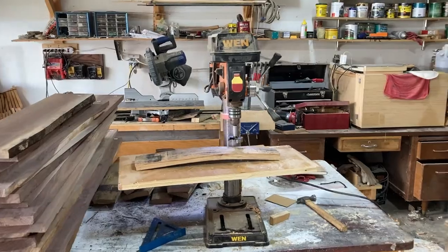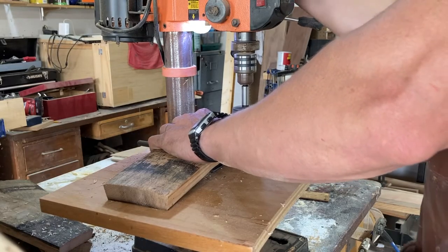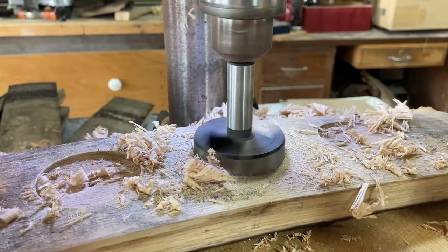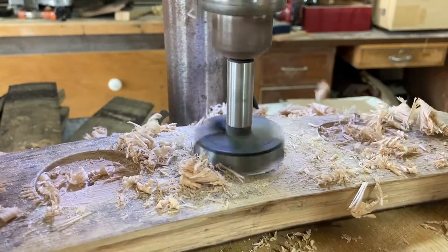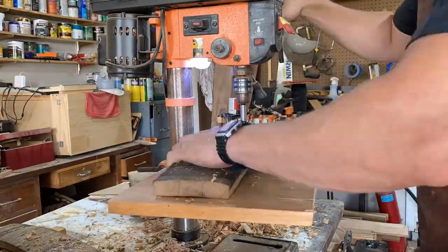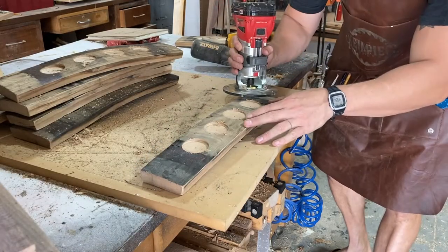You can see here I had to build a flat jig to go on top of my drill press. This is very important because as you're moving the piece and drilling all the holes, it needs to be leveled throughout the process so that your glasses stand vertically.